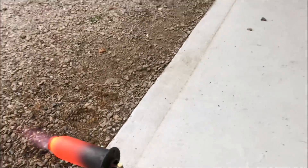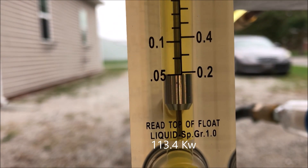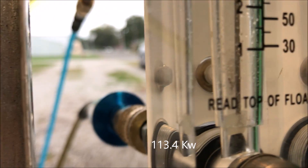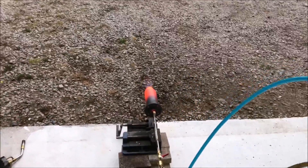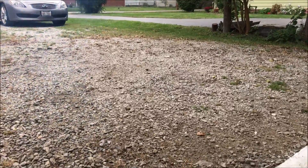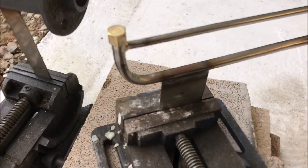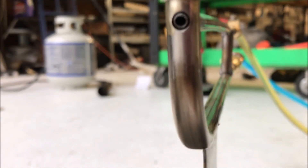Okay, right here we're burning super lean and I don't like what I see at all — it's just not behaving the way I would want it to. We're at 113 kilowatts which is substantial; that combustor should be glowing pretty good. We might have a little too much air. There's also something weird going on — for some reason the fuel flow is different on one side.